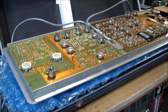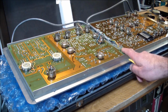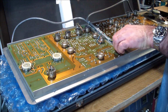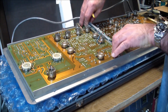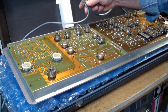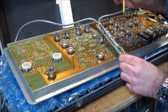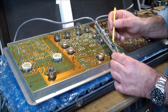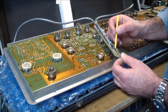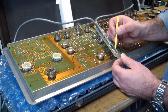So the next thing to do was for me to look at this connector, which I have loosened. And again, since it is off now, and since I was just noodling around and I didn't film it, I just pulled the connector out. What it seemed like at the time was there was an intermittent contact where the unregulated positive voltage was coming in somewhere over here, but when I measured the plus 15 out, there was nothing there.